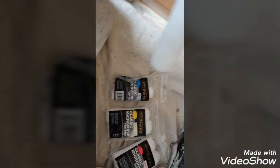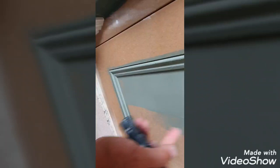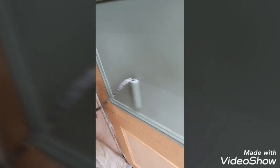This is MDF here and I'm using Otex Aqua, a water-based etch primer mixed to the color we want. With MDF, I'll leave it in a rolled finish — there's no point trying to lay it off because it dries as I'm putting it on. So far it feels really nice and gives a fine spray finish. It reminds me of the red Fussy Bloke roller sleeves. This would be good for hand-painting a kitchen or cupboard units — just lay it off like that.